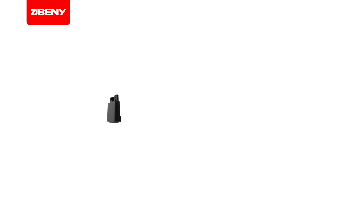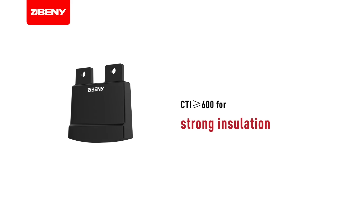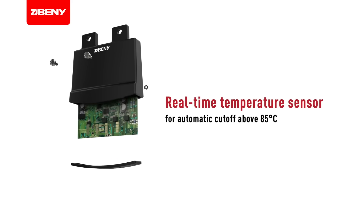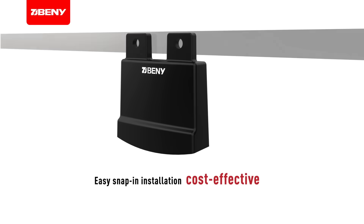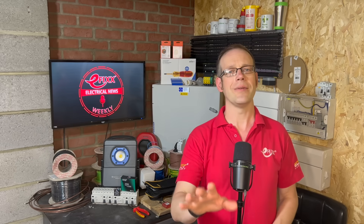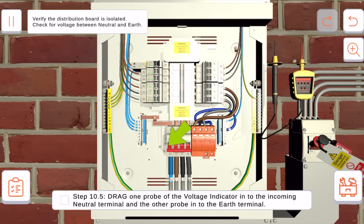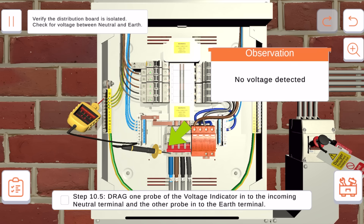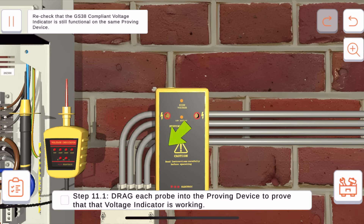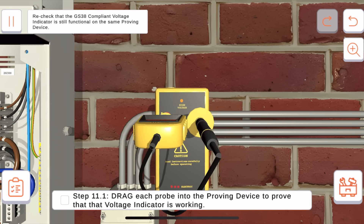Solar panel kit maker Benny has unveiled a rapid shutdown device for PV installations, making an ultra-fast disconnection during an emergency such as a fire or grid failure. It automatically switches off if its integral temperature sensors hit 100 degrees Celsius, or there's a loss of power detected by the monitor. Firefighters can also manually switch off by triggering the shutdown device. Finally, a shout-out to James Cornett of Tradefox, who's developing a training app to help promote understanding of safe isolation. A simulation takes you through the process step-by-step and it's totally free to access at the moment. Keep up the good work, James.